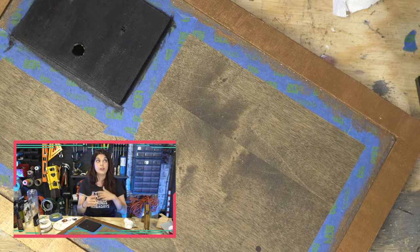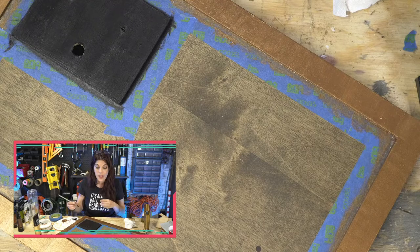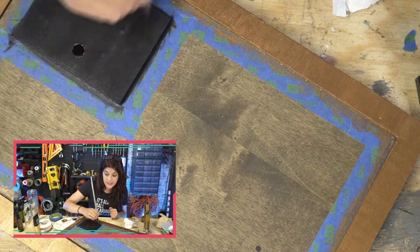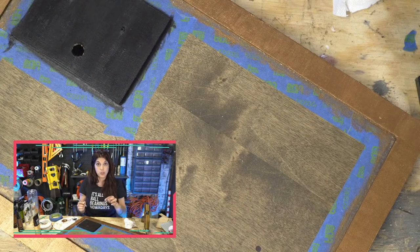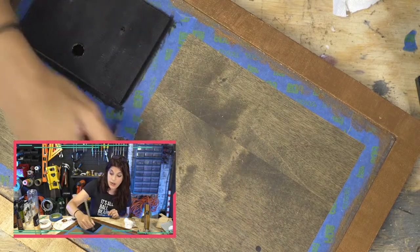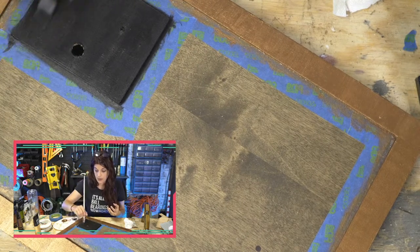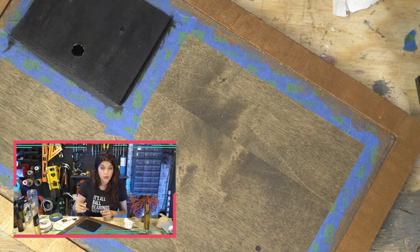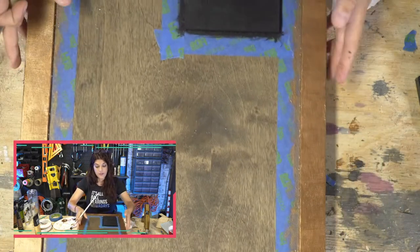We're going to be using the largest incandescent bulb that I can find and converting that into a plasma bulb, because it's much easier to do it that way. It's already sealed, and that's the way I've seen most people do it. Otherwise, you have to build an airtight chamber either out of acrylic or, better yet, glass. I am not a glass blower, and I've seen on YouTube a couple of glass blowers creating these chambers so you can make a plasma globe out of it.